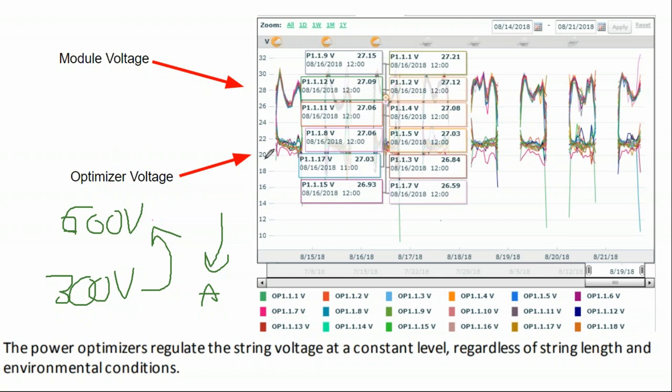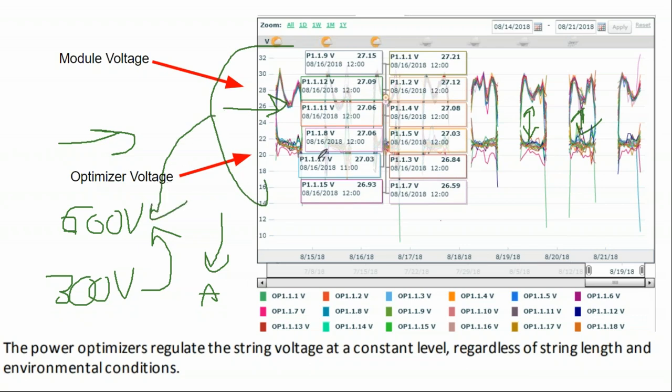What they're saying is, every voltage coming out of each solar panel is being adjusted by the voltage regulator to give you, at the end of the day, a high voltage output circuit. If one module gets shaded and the voltage on that module drops, they adjust the voltage so that the module is back up to where it would be, with a very low amperage instead. That gets rid of the series wiring conundrum where voltage differences from one module to the next can wreak havoc on system performance. By using these voltage controllers, SolarEdge overcomes that.